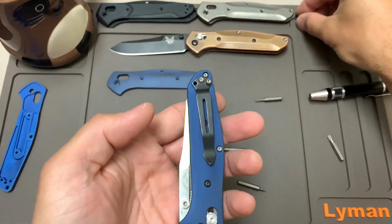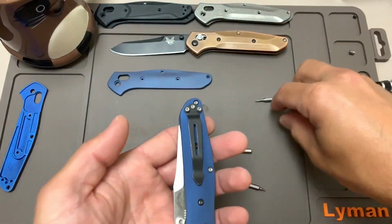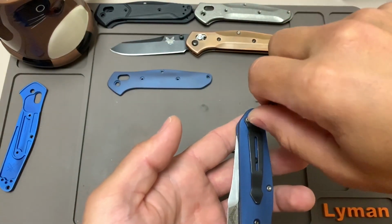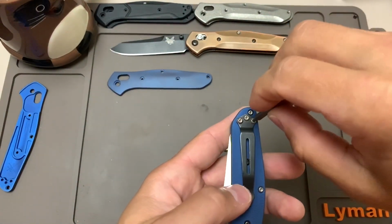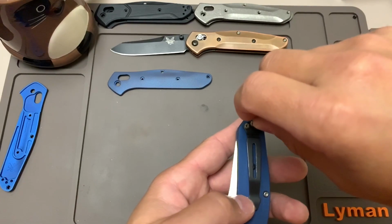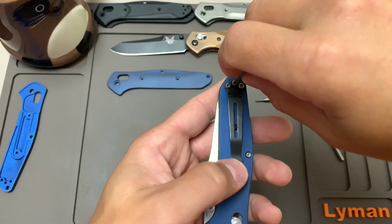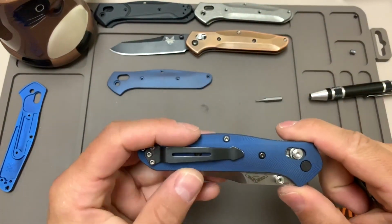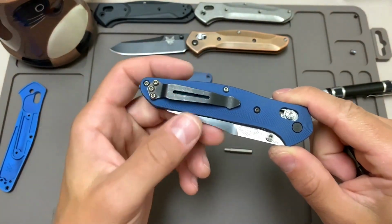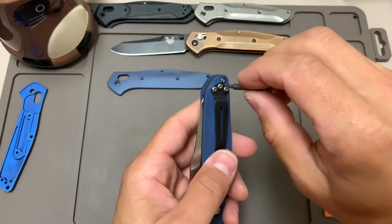And there's a little bit of a process to this, and I'll explain it. I touched on it just a second ago when I was playing with the action on the knife, and I had mentioned there's no pocket clip in place there. And I'll get to that in just a second. Let me get these screws engaged. So I want this to be pretty loose, but what I'll do is I'll come down and I'll just barely snug the middle screw, so that the blade can still move, or I'm sorry, the clip. So I'll snug that down, and then I take the clip and I push it upwards towards the spine of the scales. I don't crank on it or anything. I just move it to where it doesn't move anymore with all 3 of these screws in place, and the middle one a little bit snug.